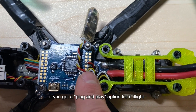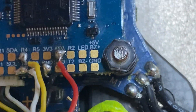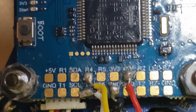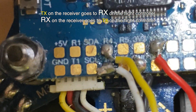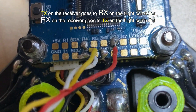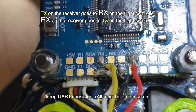I did have to solder, so I'll explain it so you can do it yourself. When you solder to the board, just copy exactly what you see here to avoid complications. The black wire goes to a ground pad, red to a 5V pad, yellow (TX) goes to R4, and white (RX) goes to T4. Make sure both wires are on the same UART number — in this case both are on 4, so they'll work together.